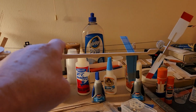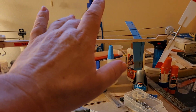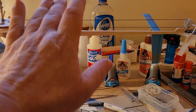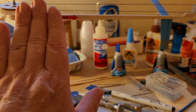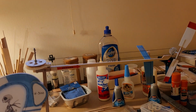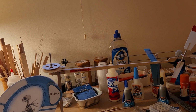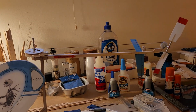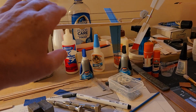Right now, I am perfect on my belt tension. See, it moves just enough. Could be a little tighter, but this is a 10-inch belt, okay, between the span that I have here. It's about 12 to 14 inches on a span. So I go about 10 inches, 9 inches. I would say probably between 8.5 and 9 is best. I'm about 10. It feels good.